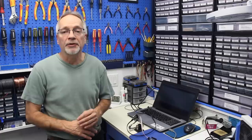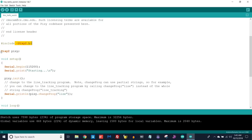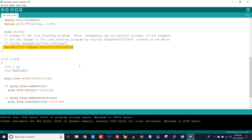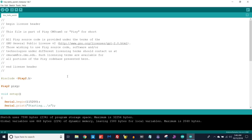Let's run a simple Arduino sketch to exploit line following, intersection detection, and barcode detection. This is one of the sketches that came with the library. Looking at the code: it includes the Pixie library, defines a Pixie object, sets up the serial monitor, initializes the Pixie, and changes the mode of the Pixie into line following mode. In the loop, it uses getMainFeatures of line following mode to get all the parameters. If vectors are detected, it prints them; if intersections are detected, it prints them; and if barcodes are detected, it prints the barcode number. Using the Pixie library, the code is very easy.